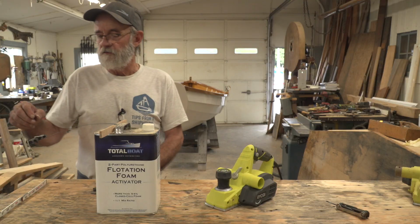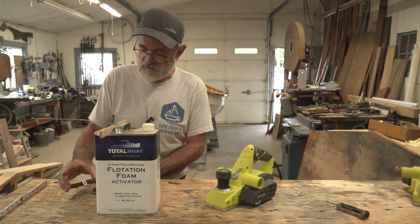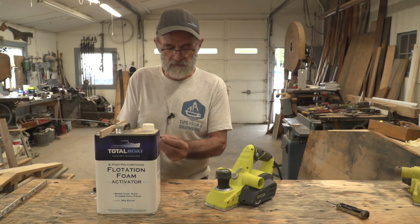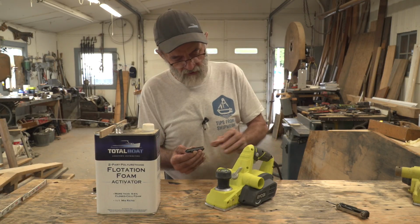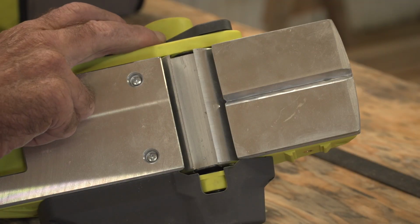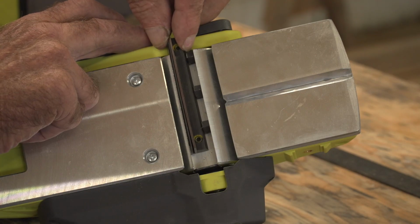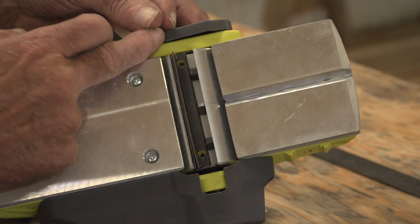That's quite a bit. Now that I know that the two pressure bars weigh exactly the same, or very, very close, I'm going to remove that pressure bar from our little scale, and we're going to go over and install them back in our machine. Now I've got to get this little guard out of the way right here before I slide my unit in there. And it goes in quite easily, actually, just like that.